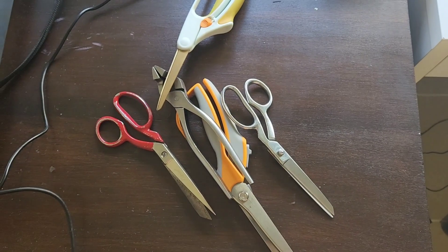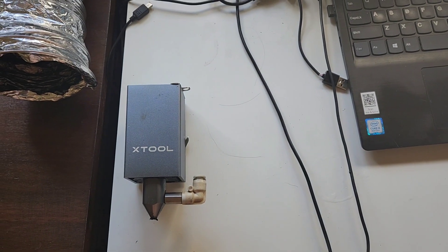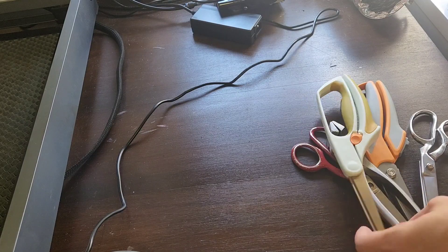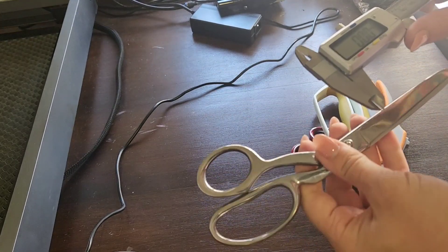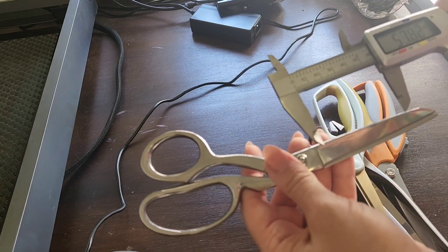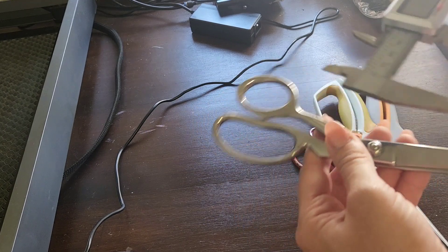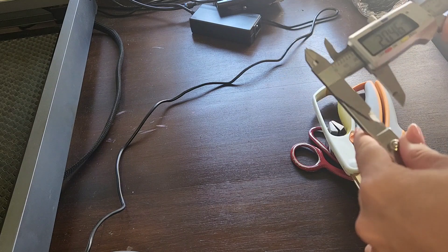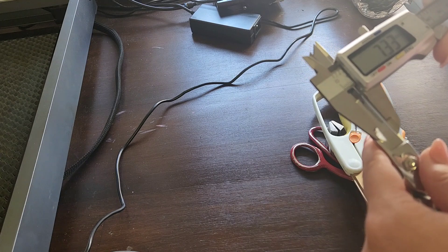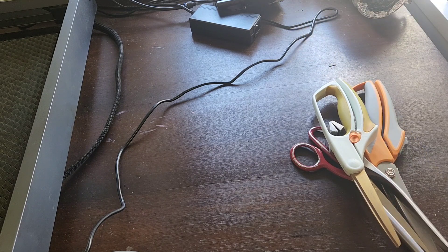Today we will need some scissors or metal things to laser engrave. I'm going to use the infrared laser, but because it's stainless steel I could have used both. Install it, turn your machine on, and then pick your first pair. I'm using a micrometer - this is just a Bunnings version - to figure out exactly how much laser engraveable space I have on the scissors. You will need to know these measurements to set it up correctly. Make sure you do both ends too in case it tapers at one end.